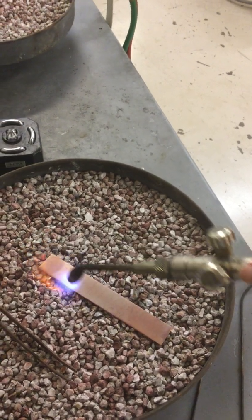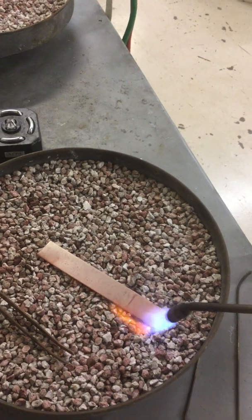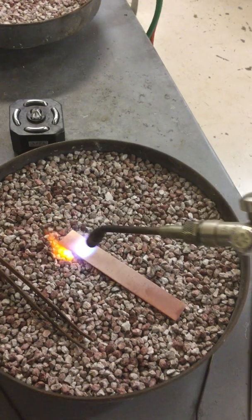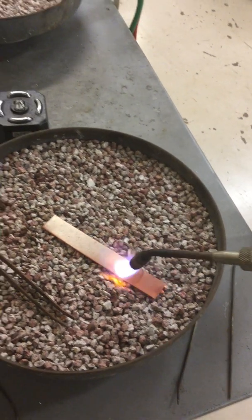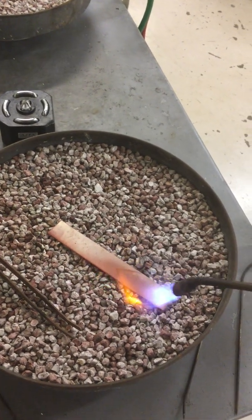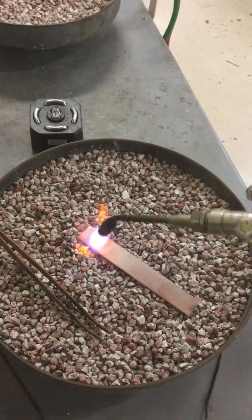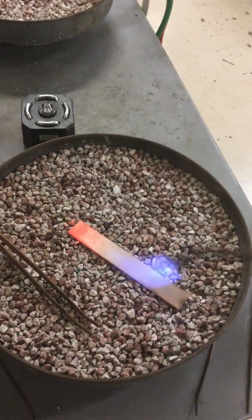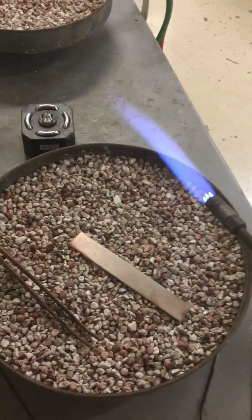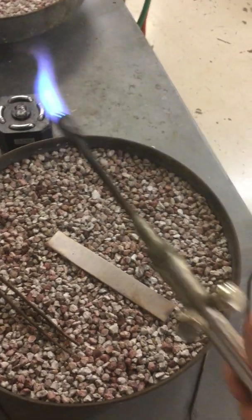It's going to turn this medium red — that's what this is, this is a glow. This is the temperature range that brass gets to. Copper as well, this medium red. Once we've turned it this medium red, and once all parts of the metal have turned medium red — because they don't turn medium red all at the same time — if I'm heating it over here, even though metal conducts heat, this other part down here is cooling off a little. So you're heating the whole entire piece of metal.